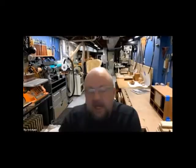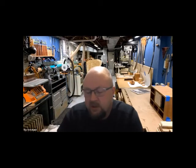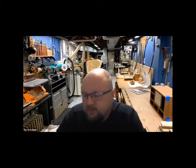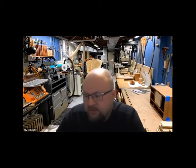So it's an old freezer that you put a light bulb in and got fans blowing, that kind of thing? Yeah, actually, I just got one heating element out of it, it's just a ceramic coil for reptile tanks. Light bulbs kept blowing, so I put one of those in there. It does pretty good. I've got a thermostat on it, and the first phase I put it in is about 90 degrees, but it'll keep it between 90 and 100 with no problem.